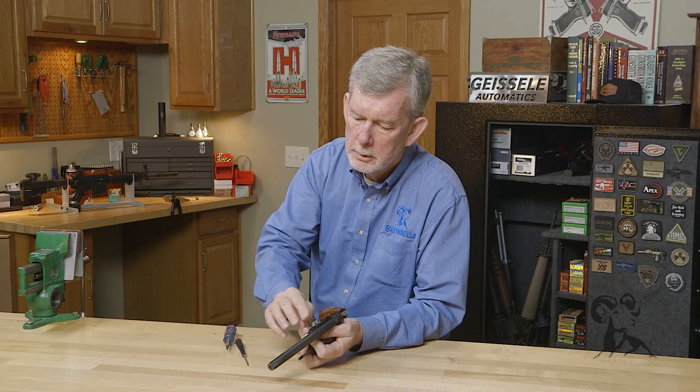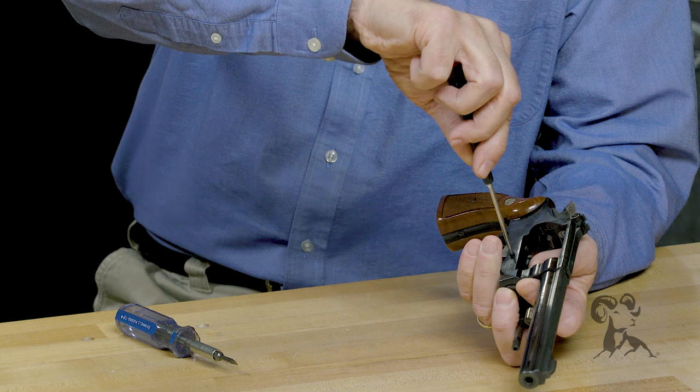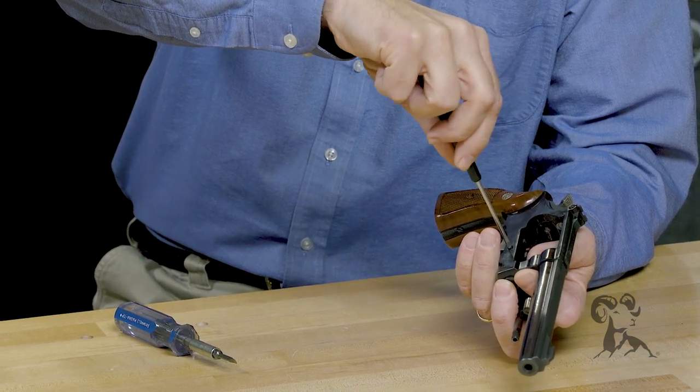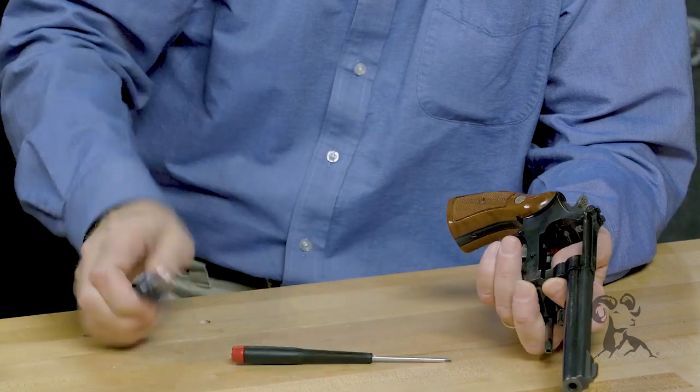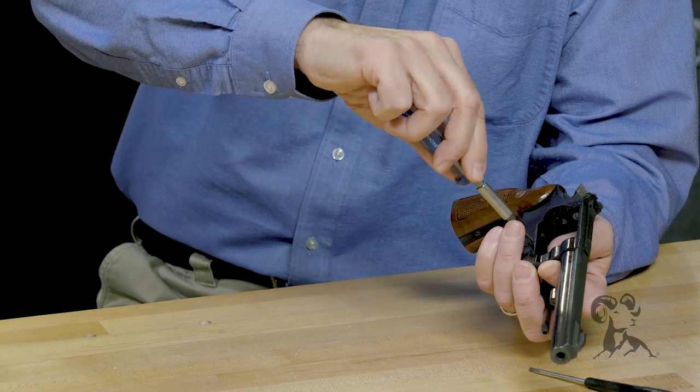More importantly, when you go to replace the screws, this gives you a little more dexterity and it gives you a feel. So you can put this in the screw, rotate it backwards till you feel the threads click into place, and then nice and easy rotate it in till it's almost snug. And when you're ready, you take your big screwdriver and do the final tightening. Nice and neat.